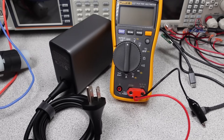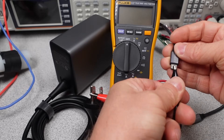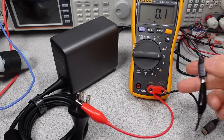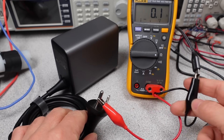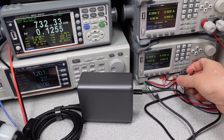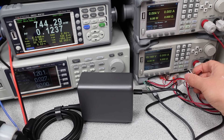The power adapter connects the USB output pins directly to the earth pin, which is common on lots of equipment but not so common on USB power adapters. Some have a resistor in the path but this is damn near zero ohms. It is allowed for metal-bodied equipment to be connected to earth, but there are situations where this can be dangerous — like a live-to-ground fault where the ground isn't connected, which would leave the USB ports at full mains potential. I'd still like to see a resistor in the path.